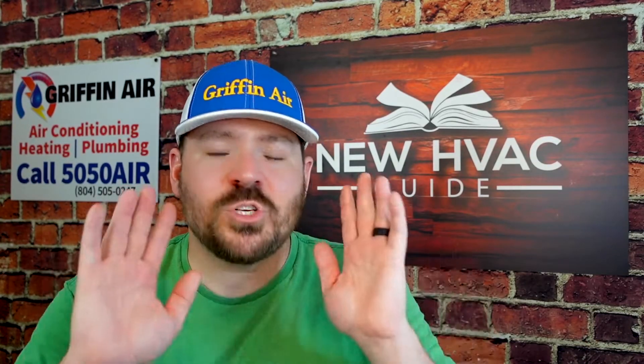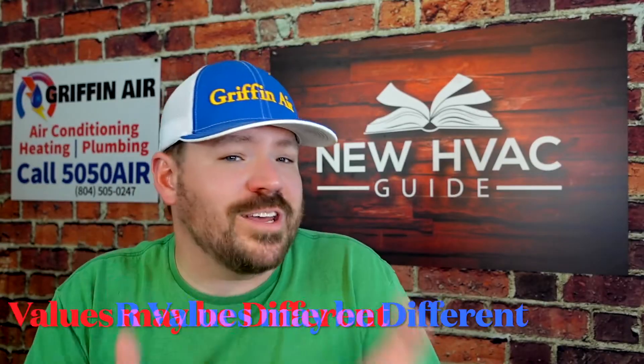What do I mean by that? The labor involved — sending guys under there to remove all that insulation and put new insulation back — in a lot of cases you might as well just replace all the ductwork itself. Your local contractor may disagree and you should follow what he says, but in many situations I explain to the customer that the extra work involved means we can just rip it all out, install new ductwork — especially flex duct, which is already insulated right out of the bag — and it'll be properly sealed and well insulated.